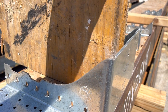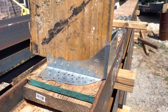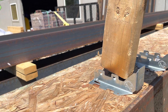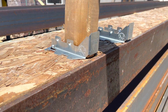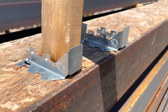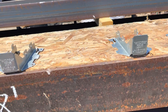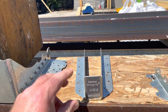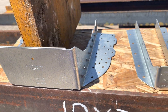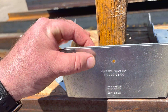Like this would be representative if we had an LVL intersecting the steel beam, it would look like that. And right here you can see, if we had ceiling joists, they would sit in these little stirrups called joist hangers. You can see we have several different flavors of joist hangers — those are smaller ones, we have a bigger one for taller stuff, and then these huge ones. These joist hangers are actually a couple hundred bucks each, because they're made out of really thick gauge steel.